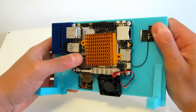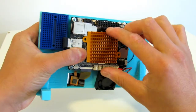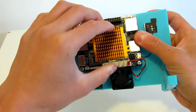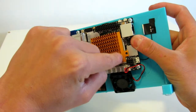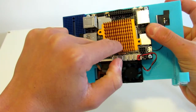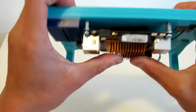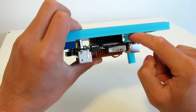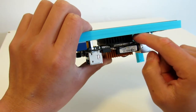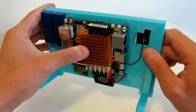Starting at the back, we have added a fan and a heat sink which has been glued on top with some thermal paste inside before gluing it down. I have only applied glue to these flat sides there, and wherever the heat sink is in the middle has been added with thermal paste. Inside there is another heat sink, a black one, which is touching the inner bit and also has some thermal paste. That one has not been glued on but it has a lot of thermal paste to make sure the contact is properly done.